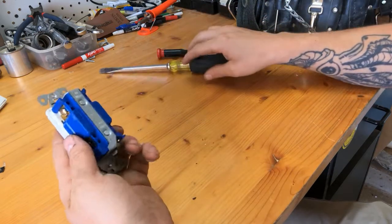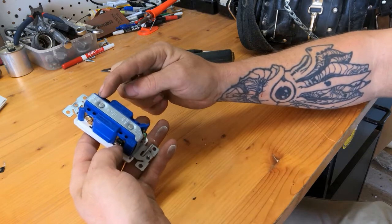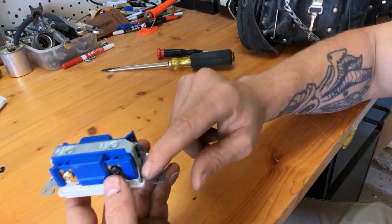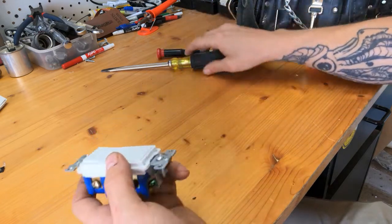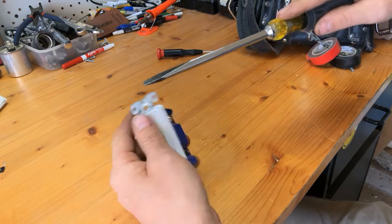On this four-way, looks like you have two common terminals. You've got an incoming side - this actually says 'in' on it - and then you've got your outgoing side that says 'out' on it. You still have a yoke that the ground is touching, so everything metal on this device is hooked up to that ground screw. So I'm going to start pulling this guy apart.